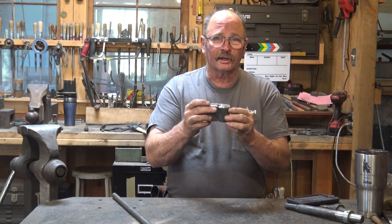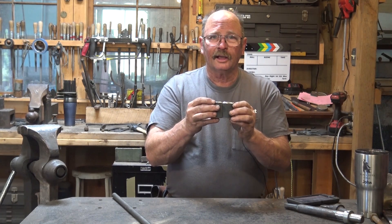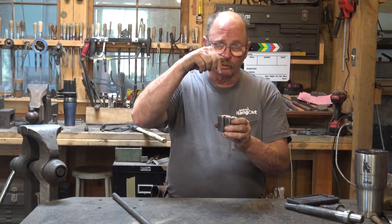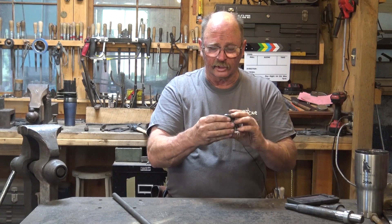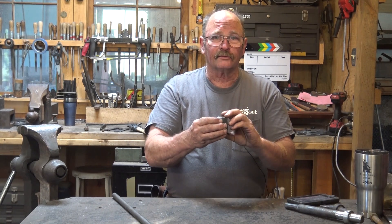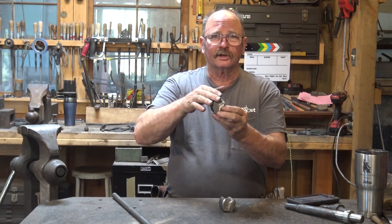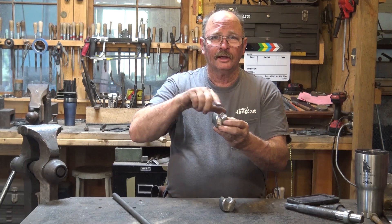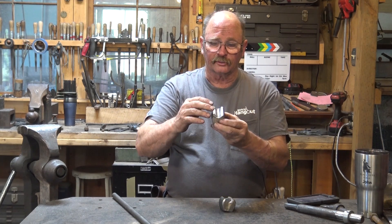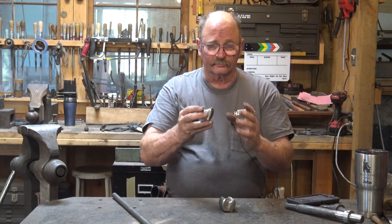You could just take your material and clamp it up with a little card spacer — a business card or something like that — in between, and drill them on the drill press. By putting that spacer in there, the drill bit will want to follow center and split the hole on either side, giving you two perfectly sized die blocks, except for the thickness of the card, which isn't much. But I decided I'd just like to forge them out on the hydraulic press. I still had to grind them and clean them up. These top edges need to be relieved back so it doesn't pinch the edges of the material as you forge it down to size. Because it's too big, that material's got to have a place to go as you rotate it. Once it gets down to size it doesn't matter so much, but since I'm starting oversized, you've got to have that relief area or you're going to really mess things up before you get to what you want.